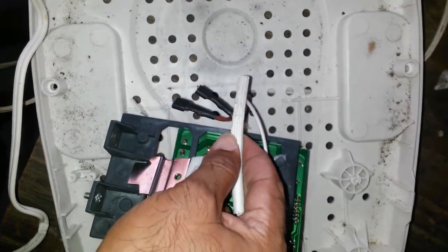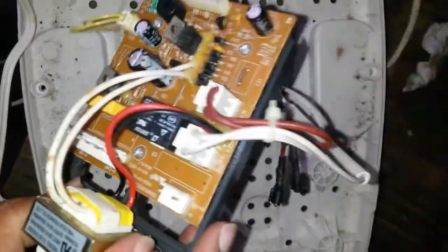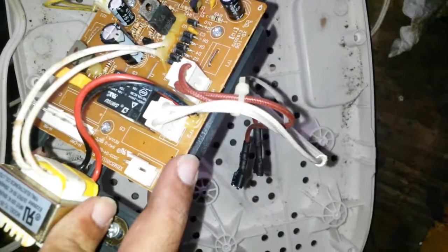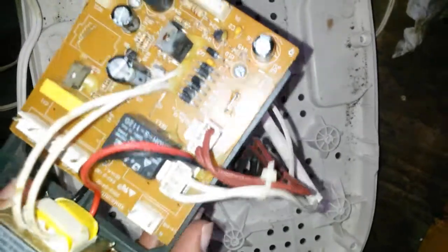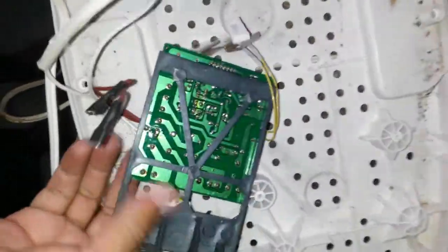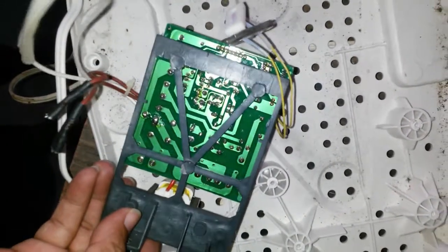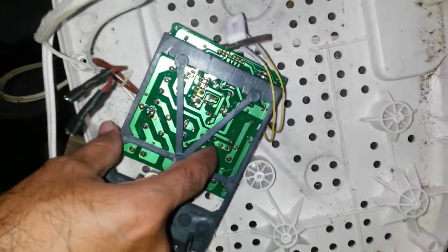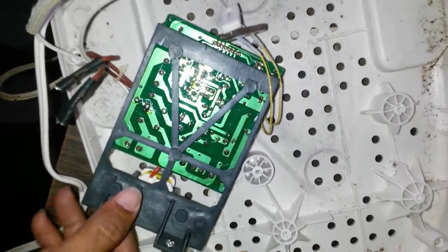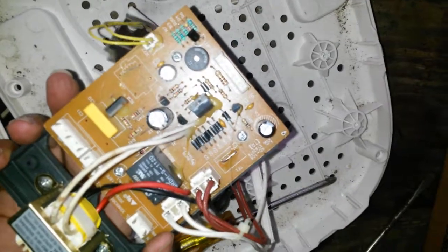I suspect this is actually a thermistor and this is possibly a thermocouple — sensing and control. I have a feeling this will physically break the electrical contact at a given set point. Tracing it a bit, it has an RTF2 and I suspect it's just a thermal shutdown — that makes sense. Somebody's done some rework here. The whole thing is actually conformal coated on this side, nothing on the other side.